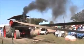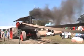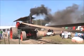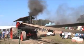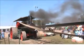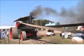I'm just doing that to make the fire burn harder. See how the smoke went fast when I did that? That portion of steam up the stack makes the draft increase and makes that coal he's putting in there throw on fire real quick. That's why I'm doing that — to get the draft going in a hurry, and then the steam pressure will come up fast.